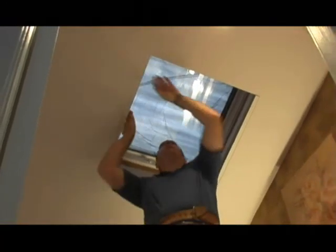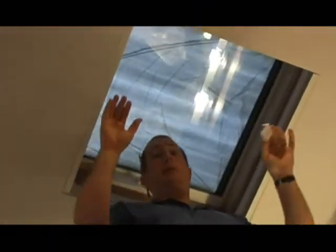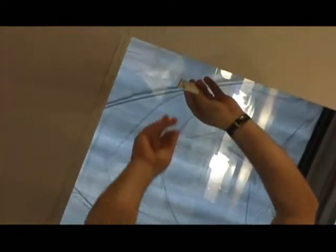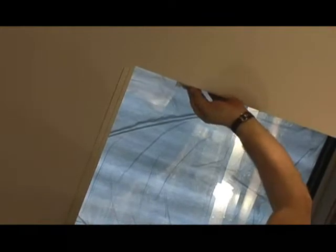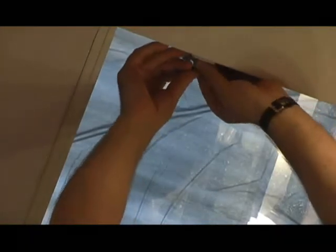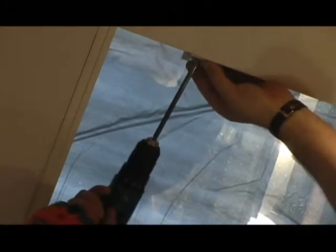The next part of the installation will be the top brackets — these are the brackets that hold the top rail in place. Depending upon the width of the skylight shade, you'll either have two or three of these brackets. The pointy side of the bracket will face down into the room and the Phillips head screw will face up toward the sky. You'll put this bracket in place about half an inch from the ceiling if you're doing a ceiling mount. All of the exact specifications on where to mount these brackets are included in the instructions. One screw through the center of the bracket will secure it in place.